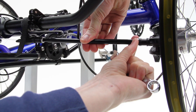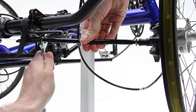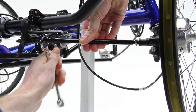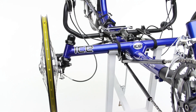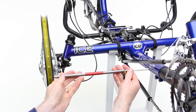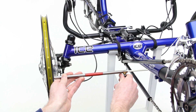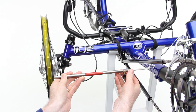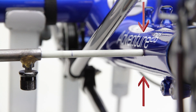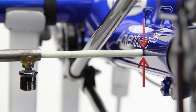First of all, make sure that the trike's track rod lock nuts are undone using a 13mm spanner — this frees the track rod so it can be adjusted. Try to hold the track rod still when initially undoing the track rod nuts. Now take your short tracking tool and place it horizontally between the rim of the wheel and the main spar of the trike, forward of the cross axle, and adjust its length until it touches at both ends. When placing your tracking tool against the trike's main spar, make sure it is always touching the widest part of the tube.